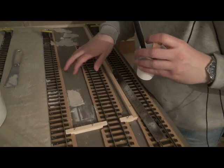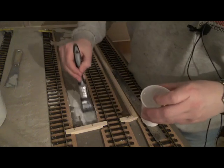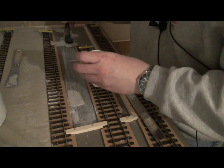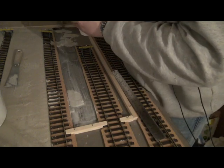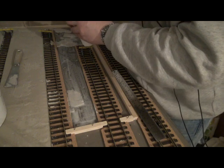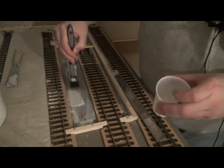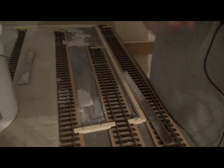So what I'm going to do first - to hold the plaster and stick it to the board, I've got some water and PVA mixture. I'm just going to run this onto the wood. It's probably a bit too thin because I've watered it down probably a bit too much, but it's just to help bond the plaster to the wood. Just give that a good coating. While it's drying, I want that to go tacky. While it's going tacky, I'm going to go back to the area in the middle.